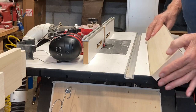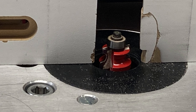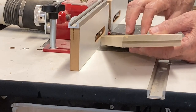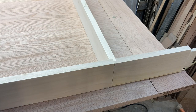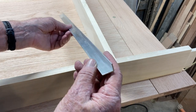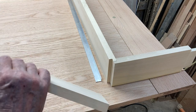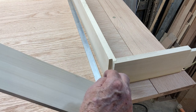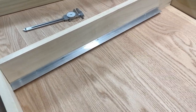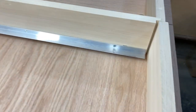The next step is to add beading to the bottom of all the aprons and the drawer front. I've got a beading bit with a half-inch shank in my router table. Now it's time to add drawer runners — I'm going to use a piece of aluminum angle iron, mount it on that piece, and raise it up about five-eighths of an inch. That way, on the bottom of the drawer, I can cut a dado to put the drawer bottom in and still have enough material that it won't break off. Got them both mounted — I think that'll work just fine. The piece I'm using is only about a quarter-inch thick, so the drawer will open and close cleanly.